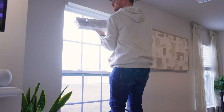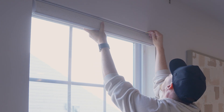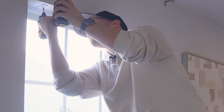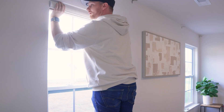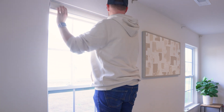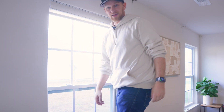Like I said, I'll link the full installation video down below. But once I got my old blinds down, I simply marked my installation location inside my windows. You can also have them made for outside-the-window mounting. Then I used the included hardware to screw the brackets to the window frame. After that, I easily popped the shades onto the brackets and that was it. This could probably be done in as little as 10 minutes if your old blinds are as easy to remove as mine were.